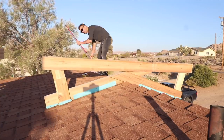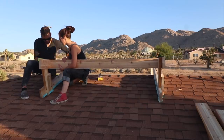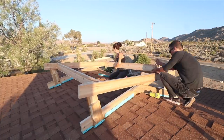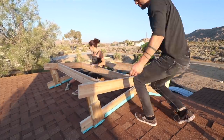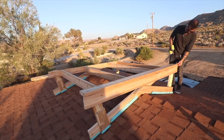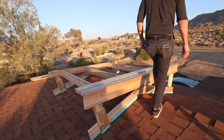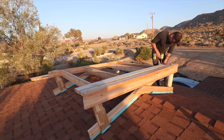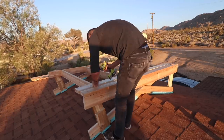We set the two roof trusses into place and then screwed in some cross supports. We used four cross supports and we didn't space them perfectly evenly because we had to avoid some of the inside pieces of the truss. Joist hangers or L brackets to reinforce these connections would probably be a good idea, but I used three-inch long deck screws to screw down through the 2x6 top deck boards and into both the trusses and the joists. We used paint stirring sticks to set the gaps between the boards — anything between an eighth of an inch and a quarter inch will be just fine.